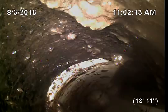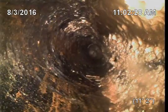So here's your Orangeburg. This is your connection, this black pipe right here. Once I get to a good spot where we can see it, you can see it holds everything, and it's paper. And so there's your look on that black pipe right there. Is the Orangeburg. It's open about 2 inches. This is a huge blister right here in the bottom. Another one. So it's squished. And then what happens is when we pull back before this, there's a huge lip right here. And then we're back into cast iron in a couple seconds.